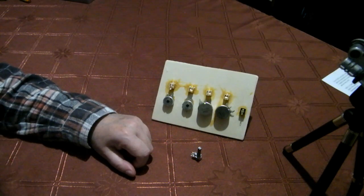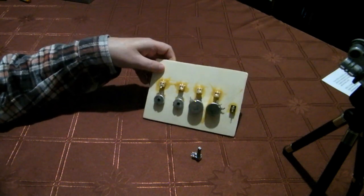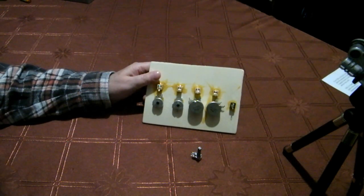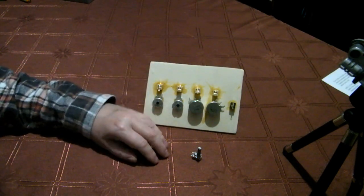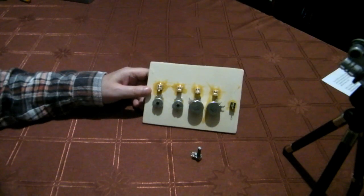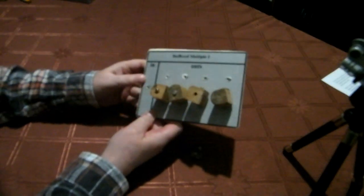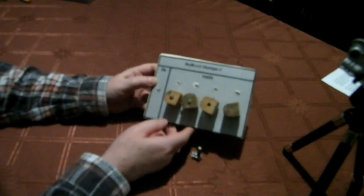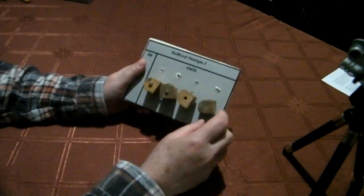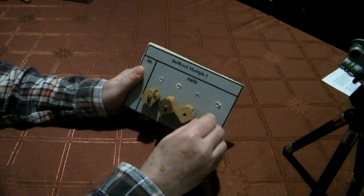I've only got 25 kilo ohm linear potentiometers, which fit mechanically, and I've used 2 of them here. Okay, and I hope it will influence only the resolution of the attenuator potentiometers, to be precise, and not the general working of the unit. We will see, maybe interesting even. Oh, and yes, I admit there are things in this world which are more beautiful than this front panel. But the only thing that's really important at the end of the day is if the module works. And it's quite nice to handle, a good feeling. Well, okay, we will see.